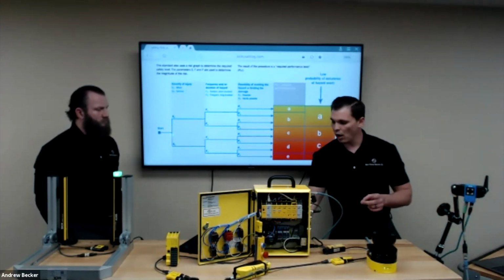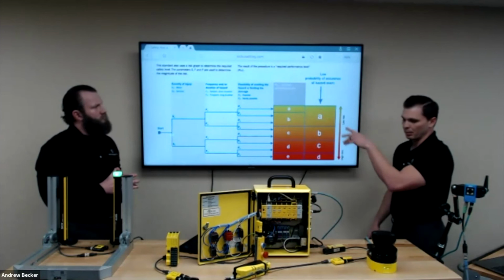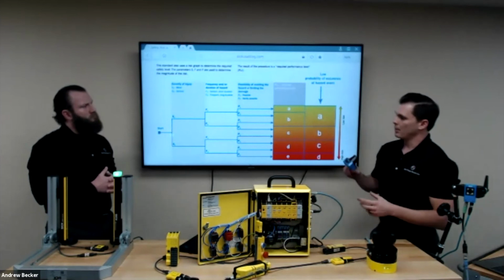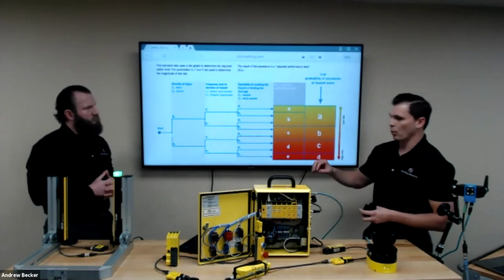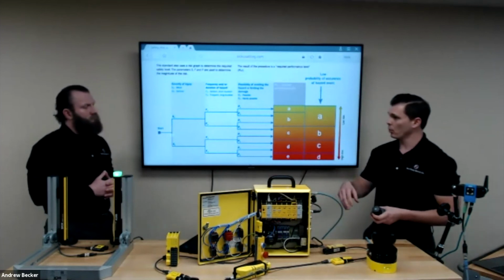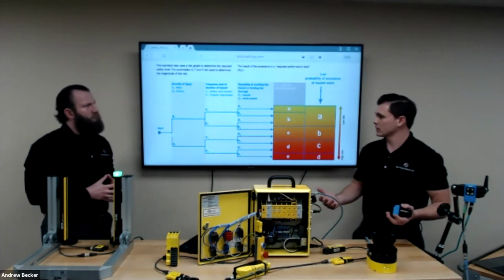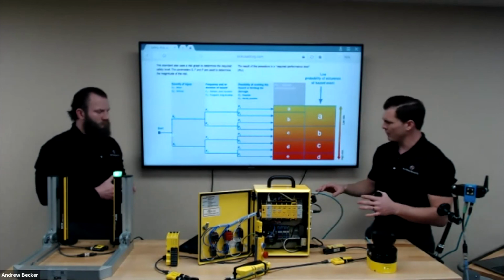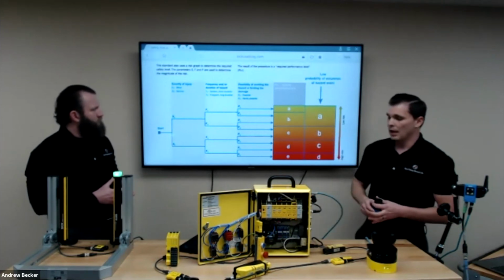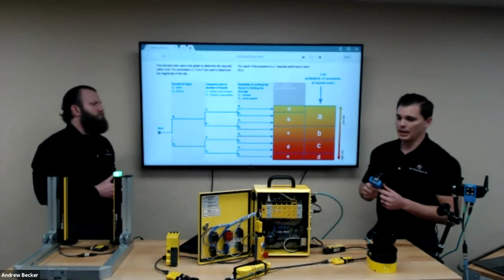We also talk about the PLE, PLC, PLB, where are you in your risk? We can use PLB for small AGVs. Think of Walmart, where you see those little small AGVs that are cleaning floors nowadays. They're going really slow. They may run over your toe or something, but you really need navigation and a little bit of safety. You don't need the PLC or PLD, but you might get away with this or the PLB.